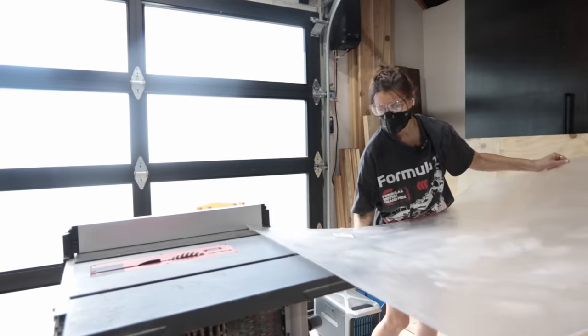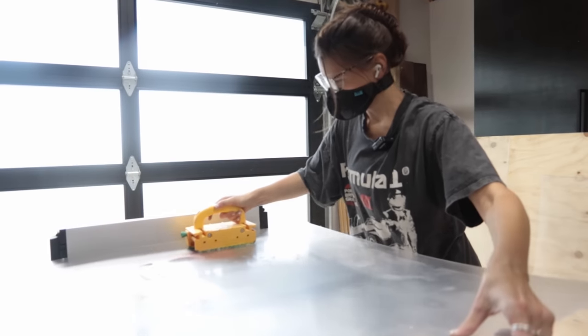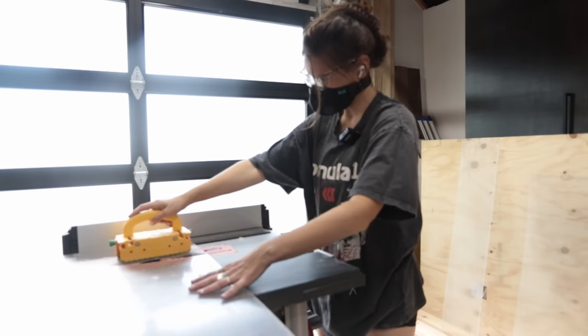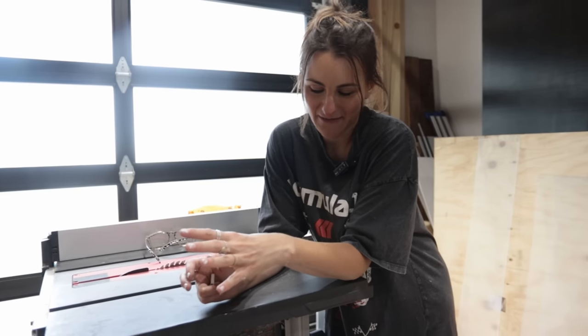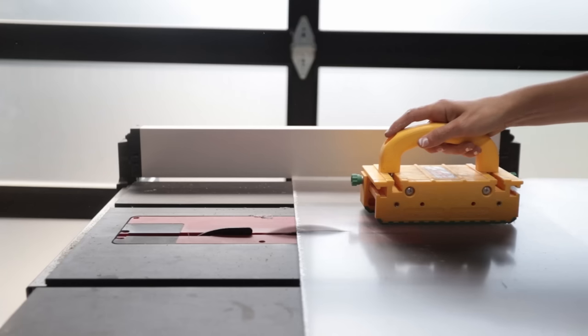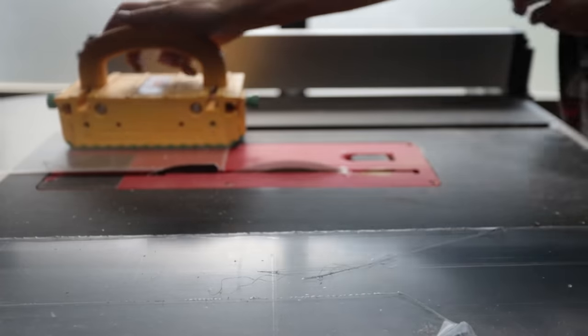The doors are drying, which is great — I think they look really cool. While the doors are drying, we are going to cut the acrylic panels that are going to function as panels for these doors, almost like what my garage doors look like. This is really thin acrylic, which means I can cut it on my table saw. It's a simple way to cut acrylic, though not the most pleasant because melted pieces of plastic come flying at you while cutting, so I'm putting on a full face of safety gear. If you don't have a table saw, no sweat — you can use a circular saw, a jigsaw, a multi-cutter, or even a blade.